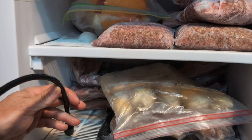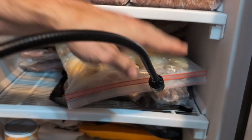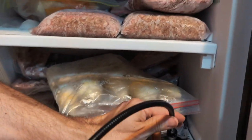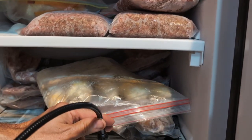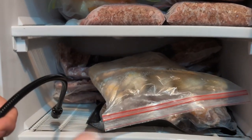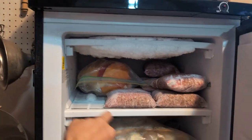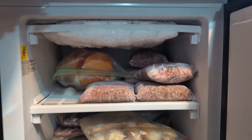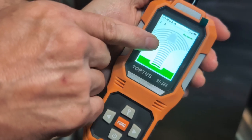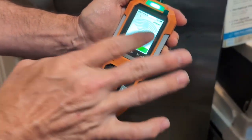Basically, you're going to be checking your refrigerant and seeing if you have any leaks on your coils. There are coils on this freezer — all through it. You're just going to go through and check for leaks. In a refrigerator-freezer combo, your unit is in the back, so you also have coils in the back of the freezer. This would go to yellow saying something is wrong, or if it's a bad leak, it would go red saying you have a refrigerant leak, which can be dangerous.